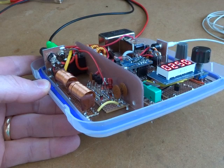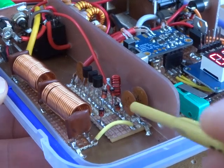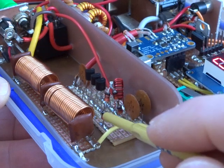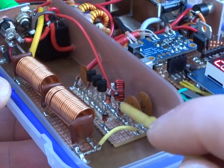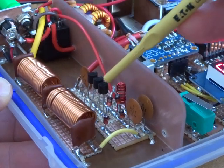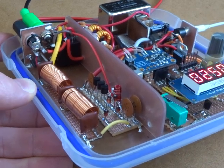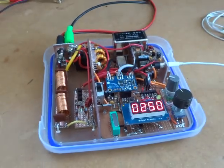The other thing I just spotted — I elected to place, on the output of that amplifier, two essentially back-to-back Zener diodes. Each side is made up of two 27 volt Zeners, so 27 volts times two on each side. I just wanted to make sure that I didn't exceed that 60 volt breakdown voltage for those MOSFETs. They don't come into play with the voltage levels we're looking at — at the moment this thing's generating about 46 volts or so across a 50 ohm load. So it's just a bit of protection, hopefully, for any kind of extreme mismatches on the antenna.